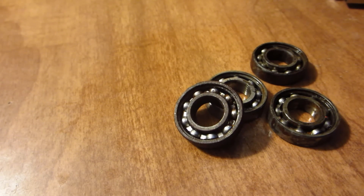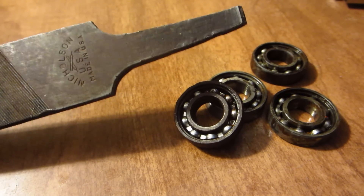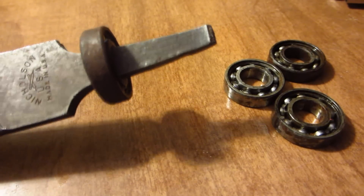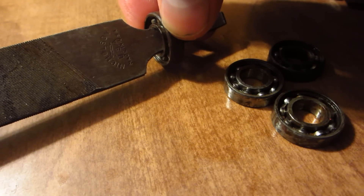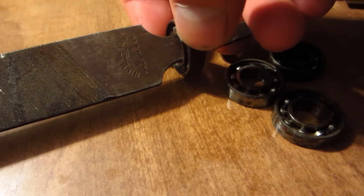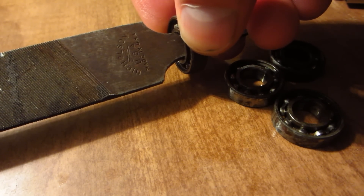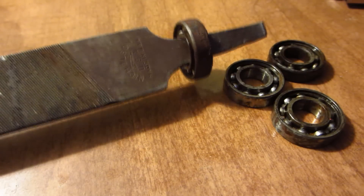To clean it up, I got my file. The file is made out of hardened steel — it's really hard stuff. What that allows you to do is shove the bearing down hard on there and it will bite on the inner race, which allows you to grab the outer race and work it. You shove it on there, dunk it in water in the sink so that stuff can fall away, and just wiggle it as much as you can. You won't start off moving it any noticeable amount, but after a minute or so it'll be moving, then moving a lot more, and then it'll be rolling freely.